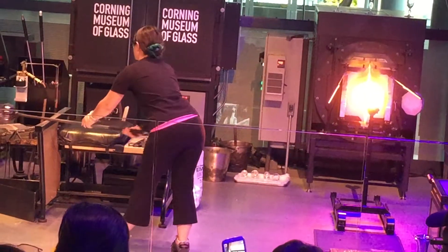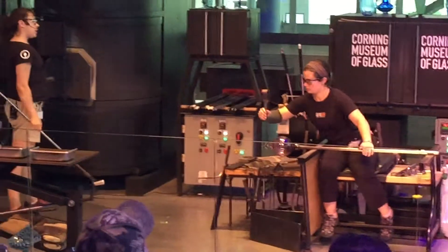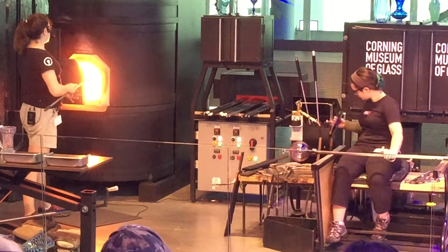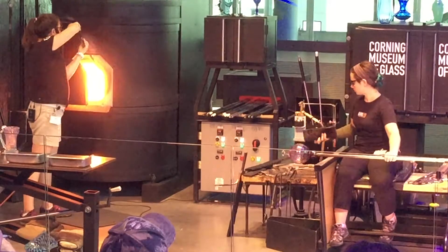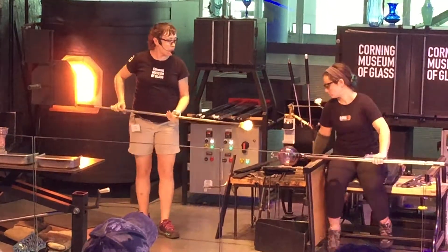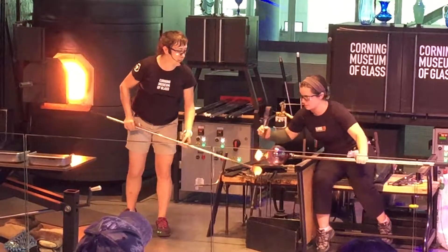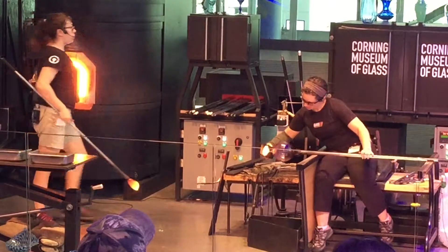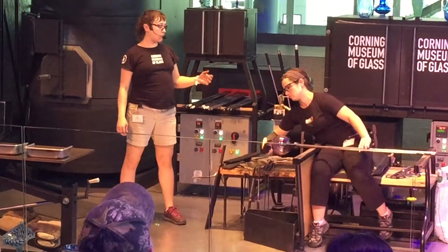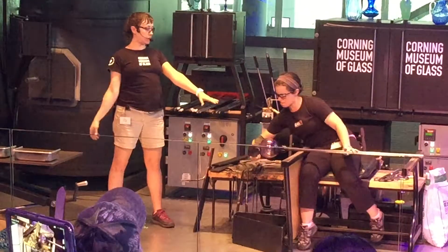The next step is to create our foot — our base. We'll use a Swedish footing tool: basically two wooden boards hinged together on one end with a little divot cut out of one of them. We'll use those wooden boards to compress the bit of glass I'm bringing over to Jamie in between those boards. Winding on that glass — pushing that hot material back with the wooden boards, then squeezing it and turning rather quickly, because when we turn glass fast and it's hot, centrifugal force will cause it to widen out. Really nice — she did a really good job.